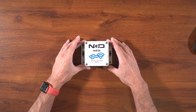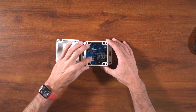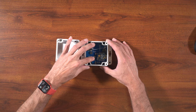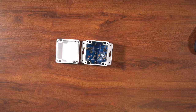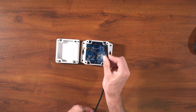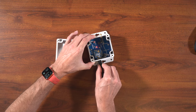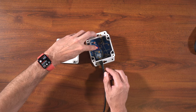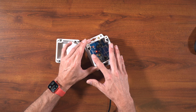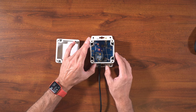This is the USB modem for our Enterprise wireless sensors. If we open it up, we can see inside that there are three LEDs: a USB, a TX, and an RX LED. The first thing we want to do is plug our modem into the USB port of a Windows computer — this USB cable will be included with your modem. We'll see a couple flashes on the RX and TX LED, and then the USB LED should turn on solid. If that USB LED turns on solid, it is properly mounted to your Windows computer. If it does not turn on, you'll need to download and install the FTDI virtual COM port driver.